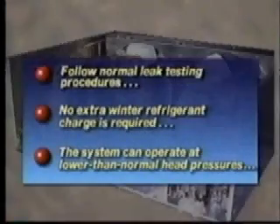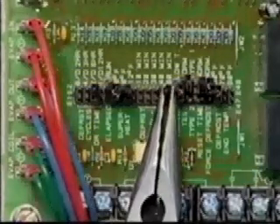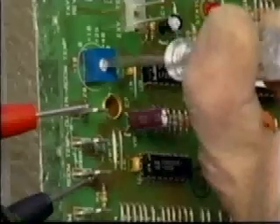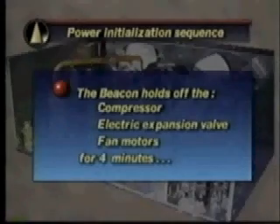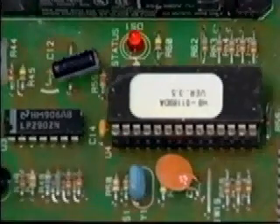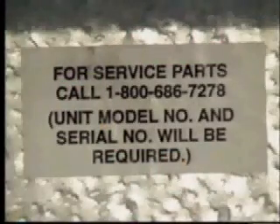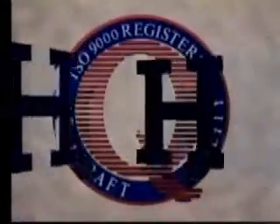The beacon system has a limited floating head which requires less refrigerant charge and operates at lower head pressures than conventional systems. System controls are set with jumpers on the beacon boards, and room temperature settings must be changed if the desired value differs from the factory default. The compressor is locked out for four minutes on initial power-up, then locked on for four minutes. The beacon board transmits LED blinks to advise operational modes, superheat data, and fault conditions. Beacon replacement parts are available through a special quick shipment program. The unique and innovative beacon system offers benefits at every level of distribution and use — from HeatCraft, the name behind the names you trust.